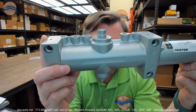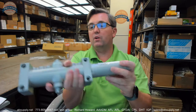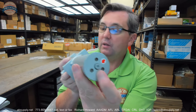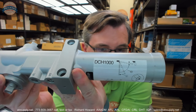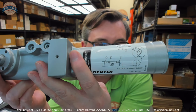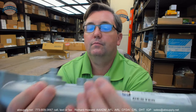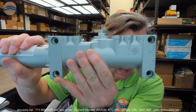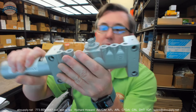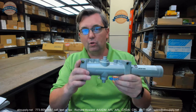This is going to be quite a full-featured closer when it comes to valve control — we're going to go over all of those valves. Installation is simple and straightforward, completely reversible, non-handed. It's going to be adjustable with the spring power. There are five places to insert a wrench here, and it has a legend on the body showing what each valve is. Speaking of footprint, the horizontal center to center is six and three quarters; the vertical center to center is about two and three eighths, maybe two and seven sixteenths — we'll take a closer look at that when we look at the template.